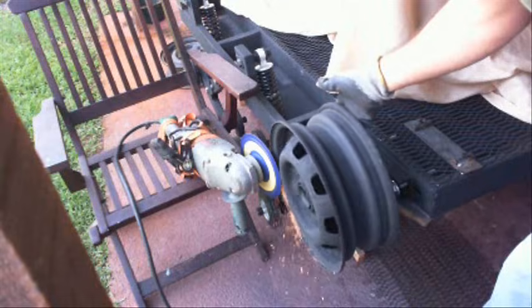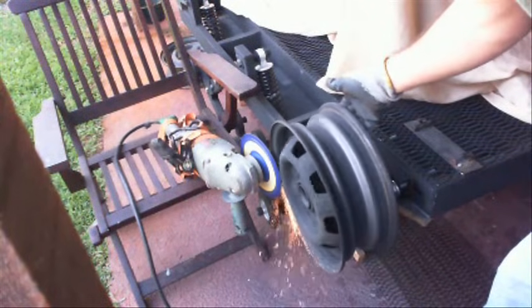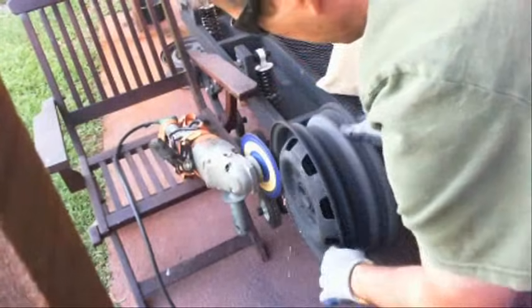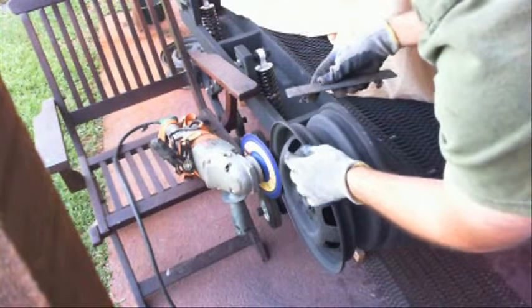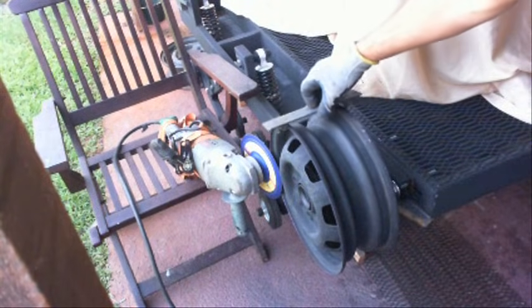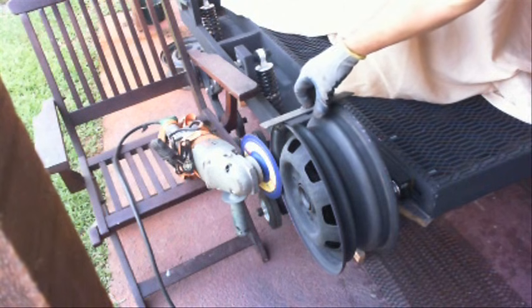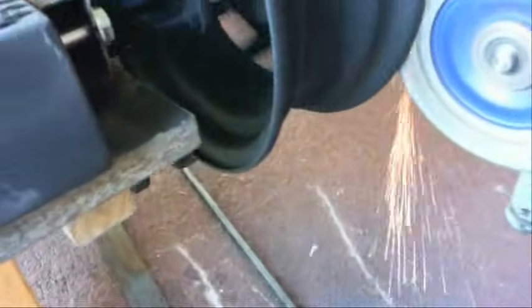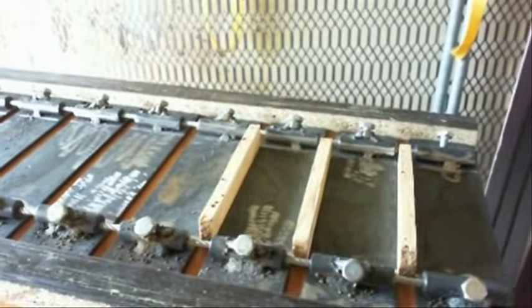When I made these, I made sure that I lined up the 3/8 inch rod on each side a little bit smaller than the rims I had. The reason is the rims aren't all equal in width. So what I'm doing now is using this grinder with the flap wheel, truing up the rims so that all four are going to be exactly the same width, since some were wider than others. That's how I trued it all up.